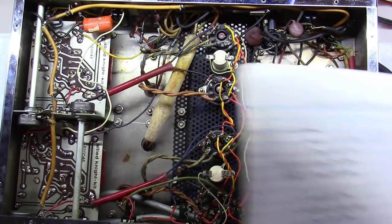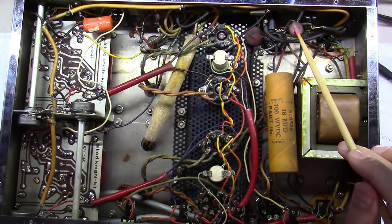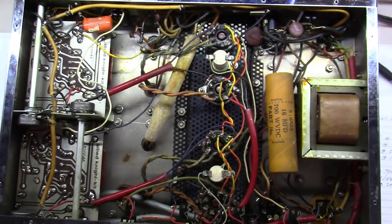I also wrote down one safety X1/Y2 capacitor — I'll replace the death cap right here with one of those. That's really the main power supply capacitors, since the can cap handles most of them. To get to the other capacitors, I've got to pull these two boards out.